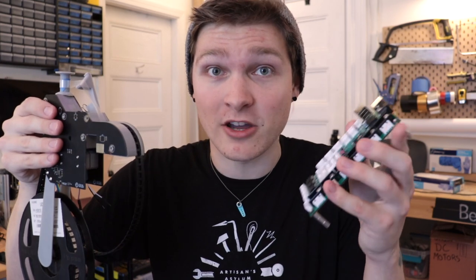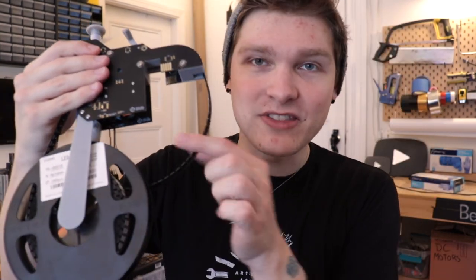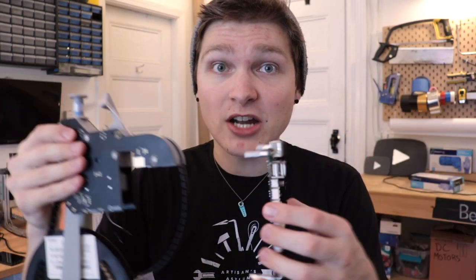There is one last physical barrier before these two can talk, and that's getting them electrically connected to each other. On the motherboard, we have a JST-XH connector. And then on the feeders, we have this spring finger connector, which is pretty much just 5 unpopulated pads on the PCB itself. So the way we're gonna make them talk to each other is another revision of the feeder floor. The feeder floor is a little piece of hardware that bolts onto the front rail of the index, and it has spring fingers that interface with this, and then connectors that plug back into the motherboard.